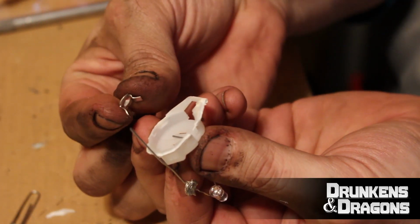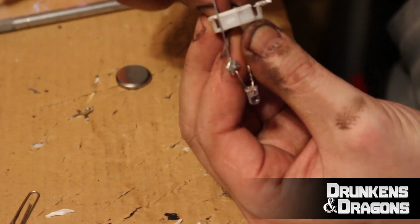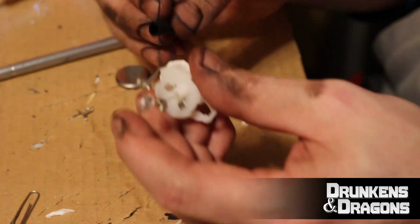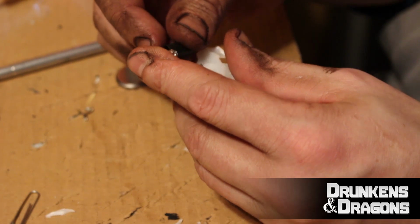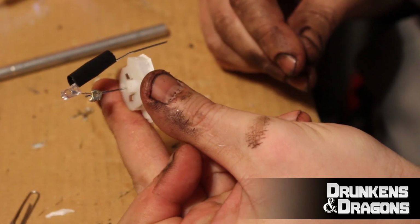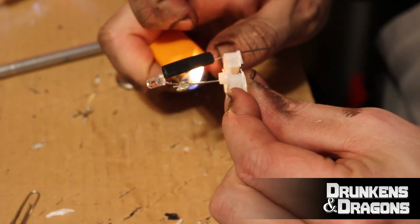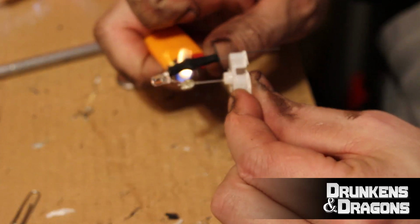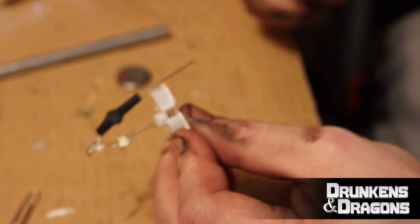We're going to replace this little guy. This is the top contact. The shrink tube from earlier, there's some shrink tube. What I can do with the shrink tube is put it over one of my solders like that, and it will prevent them from ever touching each other and shorting out. So shrink tube's pretty simple. You just put it over the connection, heat it up with a lighter, and as the name implies, it will shrink to fit. There you go. Just like that.